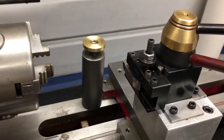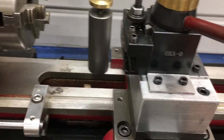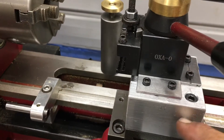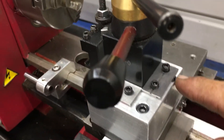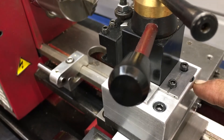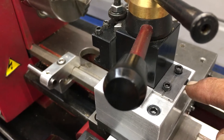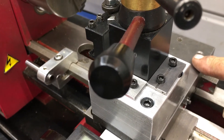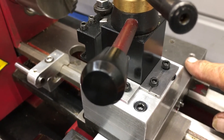I did capture all the work we did on this. I drilled two more holes — these two I was obviously using here under the plate. I drilled two more to attach this to my cross slide: clearance drilled, counter bored, and tapped and threaded quarter-20. Shot it all down.